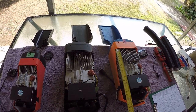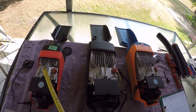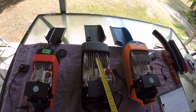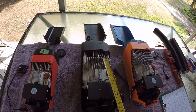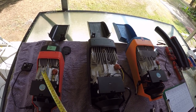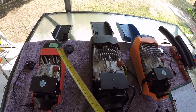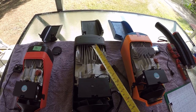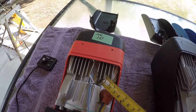The only real difference between these three heaters is the size of the heat exchanger and the combustion unit inside — this one is smaller. In theory, if you put the same amount of diesel into either heater you should get the same heat output. But in practice it's not quite like that, because the two kilowatt has a much smaller heat exchanger, a smaller diameter inlet, and much smaller fins, so the airflow, volume of air, and heated surface area are significantly less. If you look at the fins here, they're quite shallow compared to the depth of the fins in the larger heater.